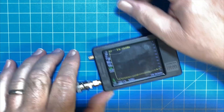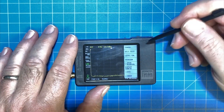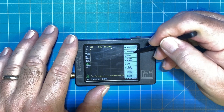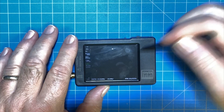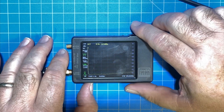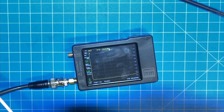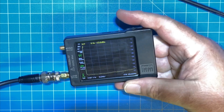I'm going to scoot it out of the way. I've got this zoomed in, hopefully it's not glaring too bad. We're going to go to... I've already done the calibration on this. We're going to go to Measure, and we're going to do Harmonic. We're going to do 146.52 MHz — that's the harmonic that we want to test right now. I am going to key up the radio. By the way, we're going through the dummy load — the CellWave sitting over here on the side, same piece of test gear that we used with the spectrum analyzer.